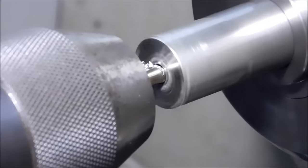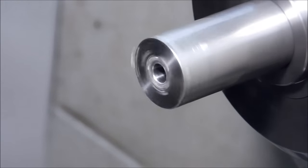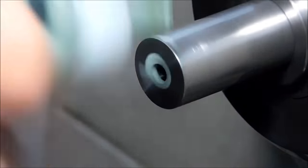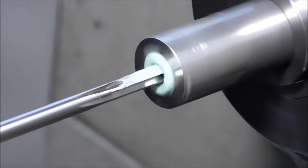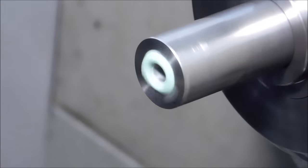Very good possibility that I am going to refloat that reamer down in that hole just to get a good feel for whether or not the hole is still tracking straight. When you put that reamer in there, if there is an eccentricity between the drill and the reamer, you're going to feel it when you crank it in. It's going to give you a little tapping feel. If it's still running concentric, it's going to float straight in, and you're not even going to know where you're at. You're just going to hit the bottom of the hole and come right back out.